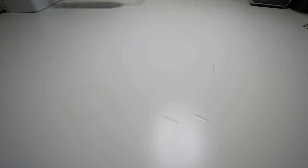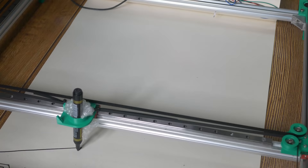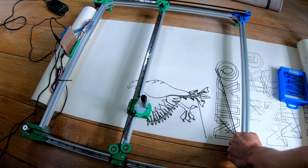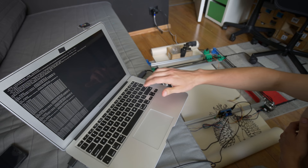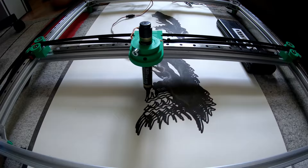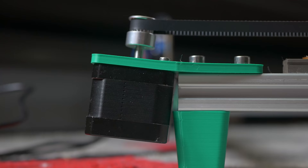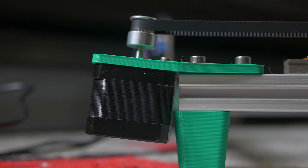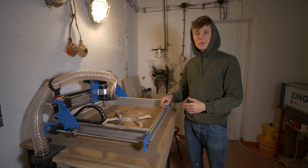So after adding a lot of upgrades, figuring out a lot of bugs in the code, and 3D printing a lot of parts, I started to see the progress and I actually started to believe that this project may be finally successful. After some more testing and tensioning the belt, I noticed that my motor plates are actually bending quite a lot because those were 3D printed. Of course I could design them differently, but I also have a CNC machine and I can machine something like this out of aluminum. I prepared the G-code in Fusion 360, so why not machine it on the IndyMil?